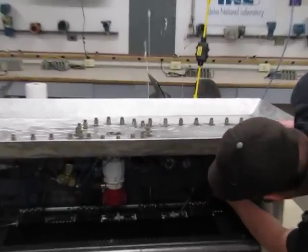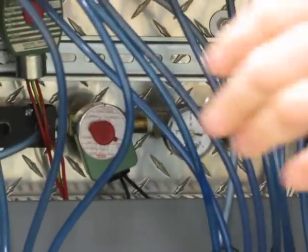This regulator is real finicky — you can barely move it. See, I'm just a hair over five. If I need to go down a little, I just twist it a little bit. It's so touchy, and it takes time to change — you can't see the immediate change. Just adjust it and leave it and see where it's at. Most of the time this is the small fine-tune adjustment; leave the regulator on the other side alone. Set it to about five and leave it there.